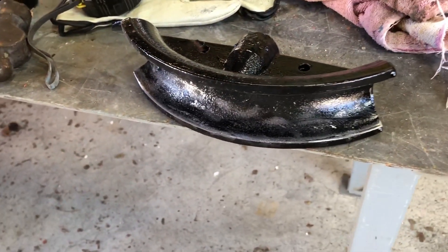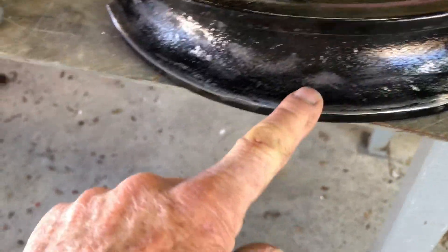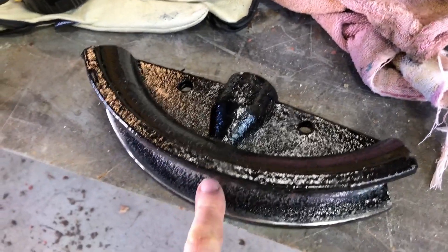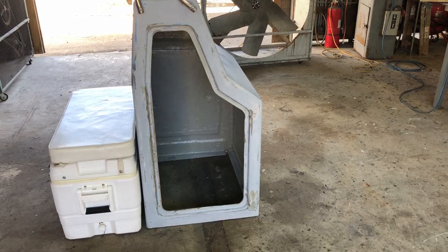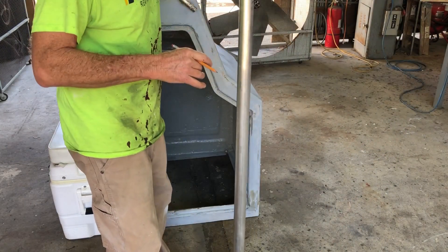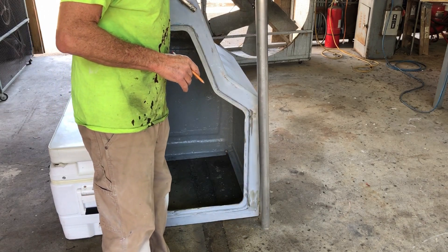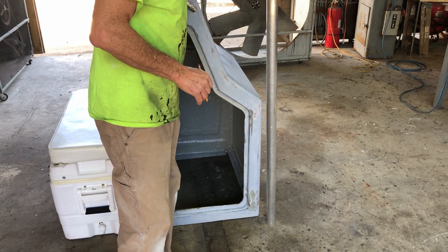The factory edges are real rough and jagged and they're leaving marks in the pipe, so I put a flapper disc on them and cleaned them up a little bit so the pipe will come out with cleaner bends. The first thing I did was cut the threads off the end and cut it square with my miter saw. That's one advantage of working with aluminum - you can use woodworking tools.